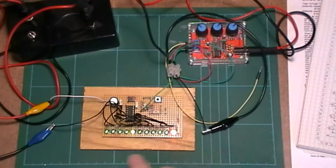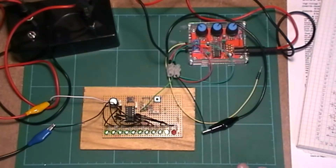There you go — it reset itself and now it's counting correctly. As you can see, it's counting up really nicely — all our outputs from zero all the way through to nine. This carry-out output you take for another stage, like another counter or a display driver. When it starts at zero, one, two, three, four — the carry-out turns on, but once it gets to five it turns it off, so the carry-out is on for half the cycle and off for the other half.